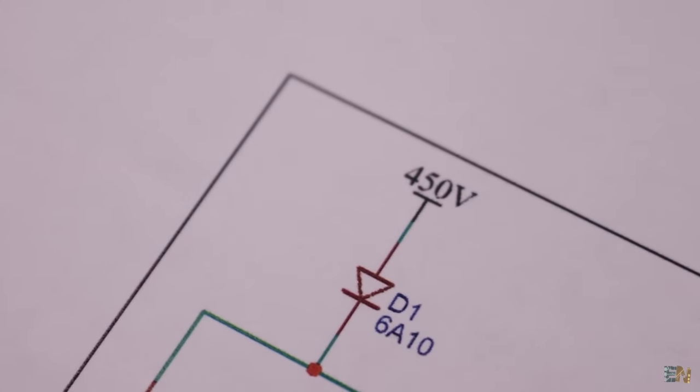Okay guys, so this is pretty much all that we need to make such a project. So we need the PCBs, obviously, the high voltage capacitors, and we also need some thyristors, some infrared LEDs and some phototransistors. We also need some small BJT transistors. And the rest are just some resistors and some LEDs. And we also need the copper coils.